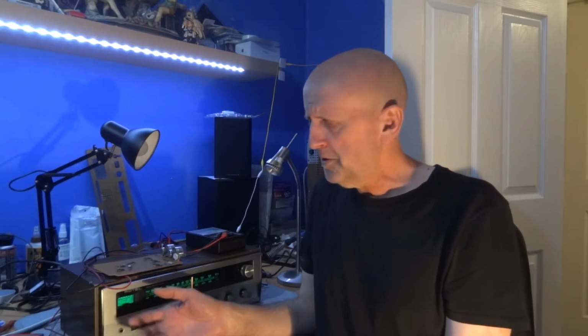The other iron I've got is a 100-watt iron, and it's just too hot. It's all right for doing joints on bits of metal, like the earth of the case or something. You've got a lot of solder there, because the casing will suck the heat in. So a 30-watt iron would be useless. A 60-watt may be okay, but the 100-watt will do something like that, or a more heavy-duty kind of job.